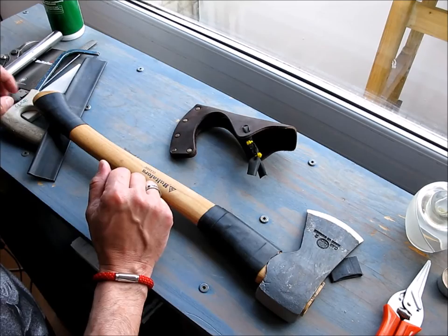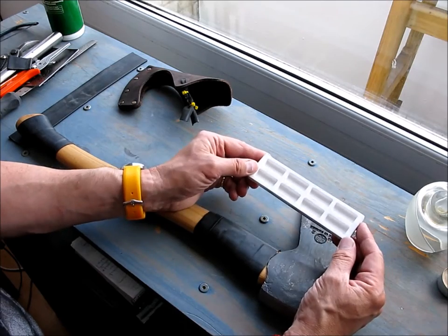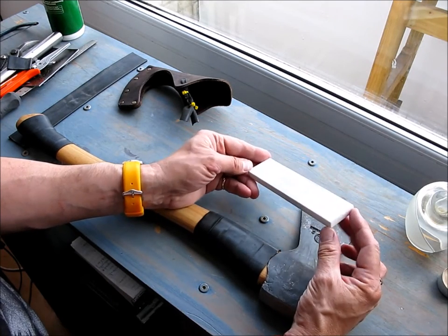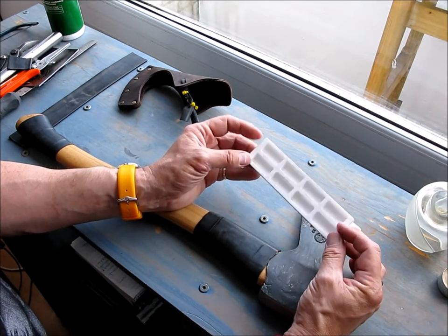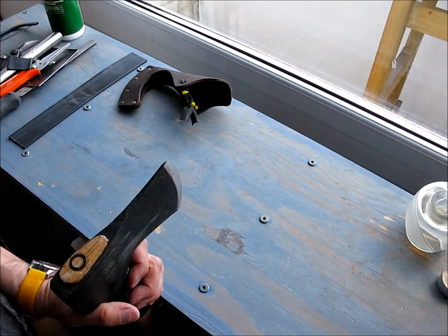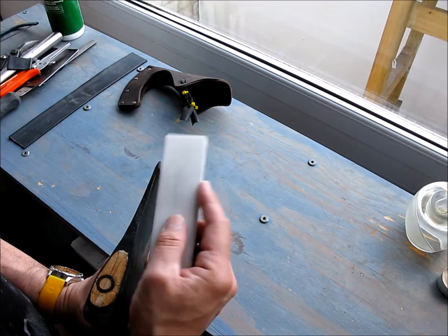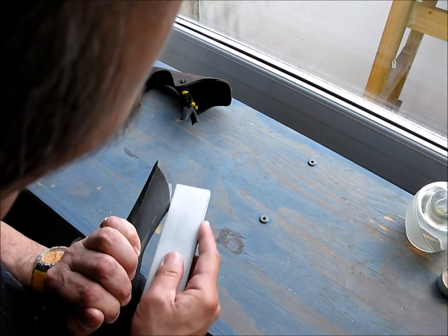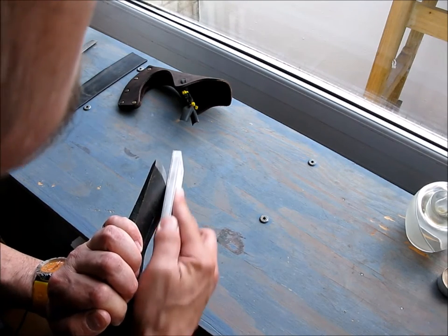The other thing I'll show you is how I sharpen my axe. What I've got here is a ceramic stone. I got it from knifecenter.com in the USA — it's made by Smiths. This has to be the best value knife sharpener on the net right now. I paid less than three dollars for it — $2.98 on a special offer. I put this on a slightly lower shelf and then choose my angle — about 20 degrees on either side — and just go up and down keeping the angle exactly right.